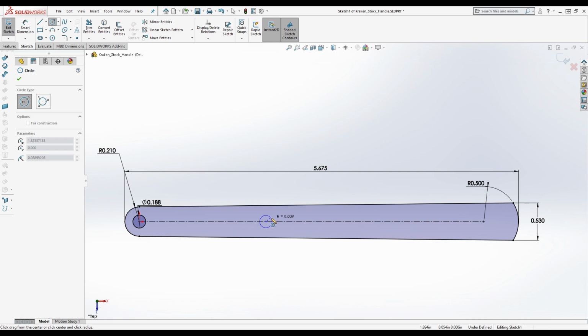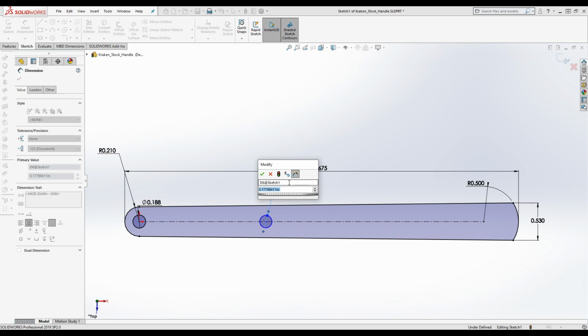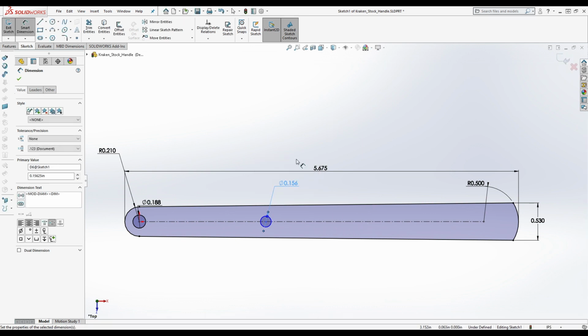So this is a 5/32 inch hole right here. Because when we measure this, we're getting 0.155, 0.1555, 0.155, 0.1555, and 5/32 of an inch is 0.15625, okay? So it's not far enough off to be indicative of any kind of a different size. Clearly this is a 5/32 inch drill, and he would not be reaming a hole like this. So it's not out of the question that it would be undersized either. So that's a 5/32 inch hole.